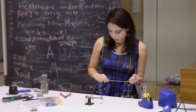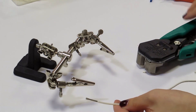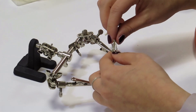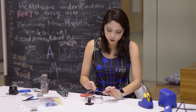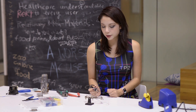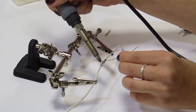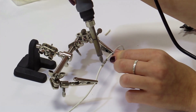If you have stranded gauge wire, different ball game. Again, we're gonna strip this wire. The thicker the wire you have, the more you want to strip down. With the twisting, what I like to do is actually fan it out and break it in two like this, kind of link them like a diamond and then twist. This is a pretty solid joint — there's a lot of wires tangled together there, that's not going anywhere. Get a nice big glob of solder to tin this, then push your solder in. I'm laying the side of the iron against the wire — that's just to allow more surface area for heat to flow.